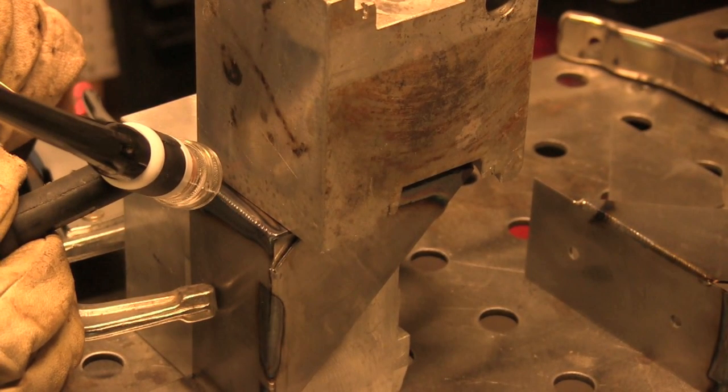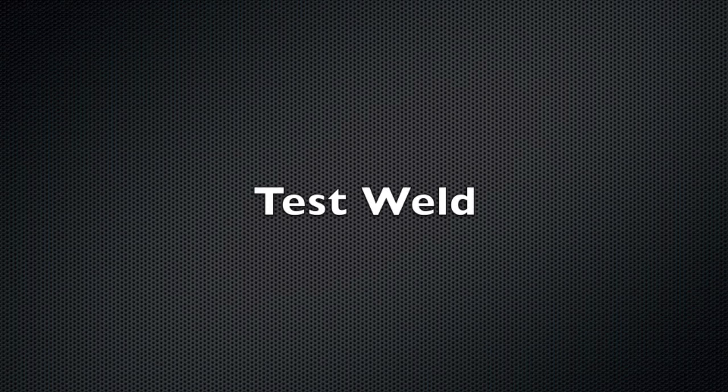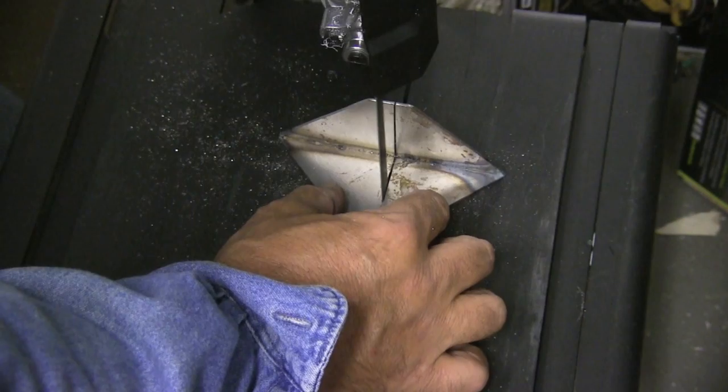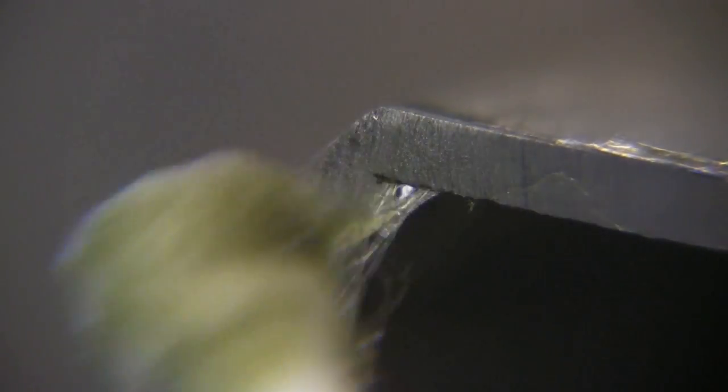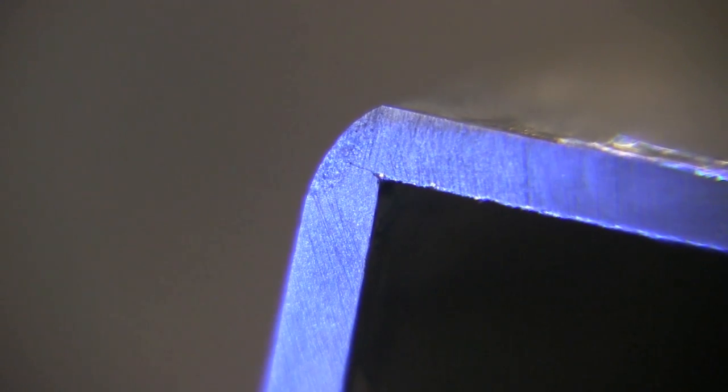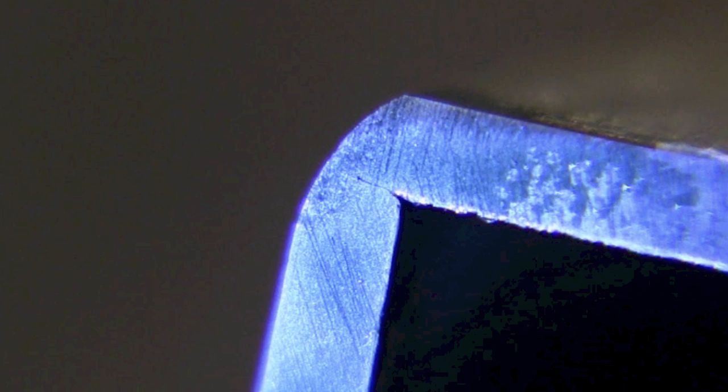Just for kicks, I'm welding one without pulse and with filler metal on one of these outside corner joints. Then I'm doing a test weld on scrap pieces using one and a half pulses a second with those same settings — makes for a nice looking weld, almost discoloration free, and almost penetration free on the back side too. I put it right down the middle and do a little polish and etch to highlight the fact that you don't always get what you think you get. On a little fillet weld outside corner joint like this, you can see it's not even quite half the thickness of the metal. For this little bracket that is not a problem, but on a part that's going to experience vibration or thermal cycling, that would probably crack after a while.